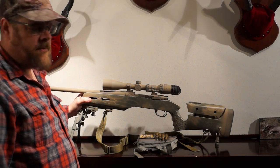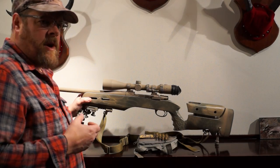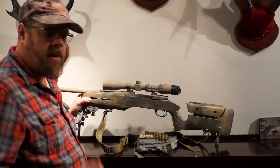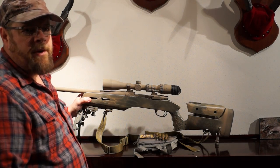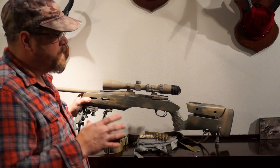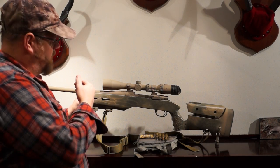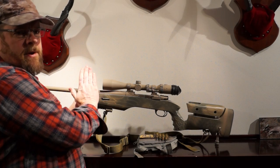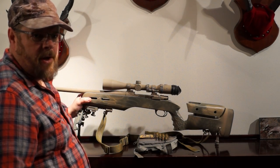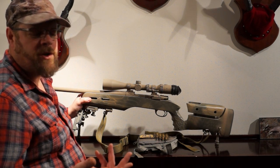We also covered the scope cap. On the rear scope, I always like to have something to cut the light a little bit from cross-parallax reflection — the wash light that comes between your eye and your scope. Doing this makes your image a little bit darker and crisper by removing that light. Same with the front shade, which removes light crossing right in front of your scope that would wash your image out and make it too bright. The shade actually makes your image a lot more bright in a high-contrast way, not a washed-out way.